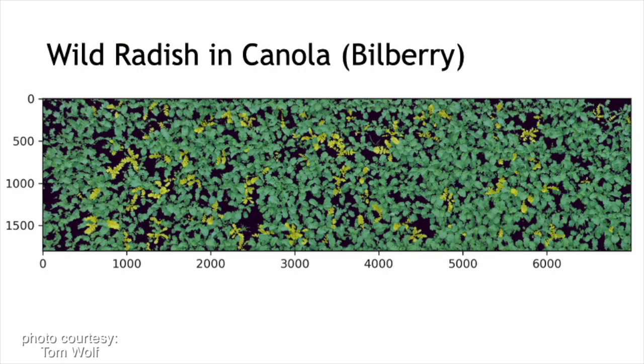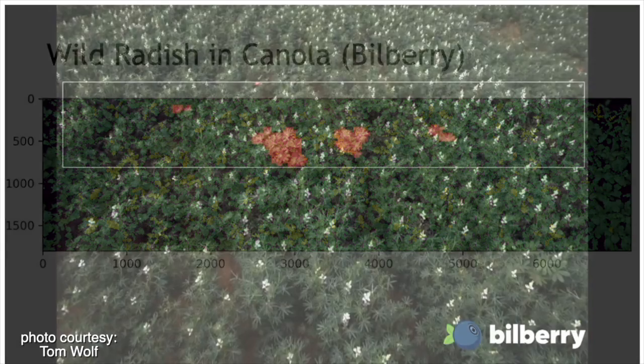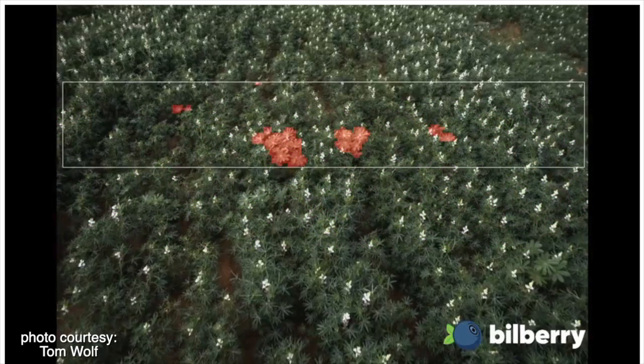What is the advantage of the green on green technology? It's a huge advantage. Imagine being able to spray weeds that occur in patches — just the patches. The big problem with precision spraying is that maps are difficult to create because you have to walk a whole field to find where the weeds are, and maps don't last very long because there's seasonality and a different emergence pattern every year. Green on green has solved that by generating the map instantaneously — if this is a weed, let's spray it. It's right here and it's right now.